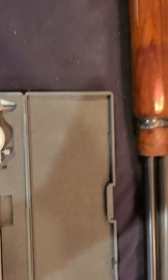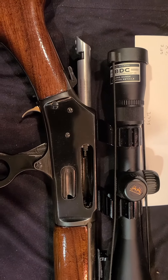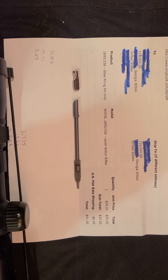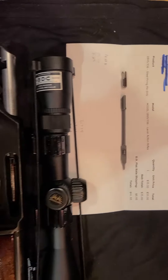It had been hinted before that the right thing to do was to replace the old two-part firing pin with a solid. It's interesting to note that this is not the original — this is a replacement that I bought — but unfortunately the replacement parts together were a full tenth of an inch short on the micrometer versus the damaged two-part firing pin that I took out. Upon replacing the old firing pin with this new solid firing pin, the rifle works just fine. For what it's worth, the two-part firing pin was a full 0.05 inches shorter than the solid firing pin, which being a solid piece maintained its integrity when pressing forward into the cartridge.